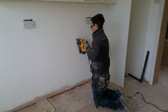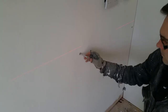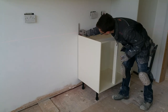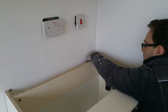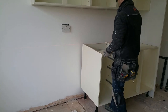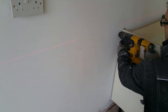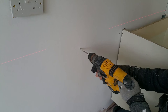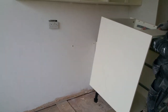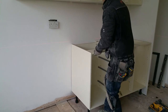With the bracket locations marked, I can drill for the fixings. Move the cabinet back, trying not to disturb the feet. One final check and I can secure in place. I'll repeat the process for the next cabinet. Clamping the cabinets tight together closes any gaps before adding screws.